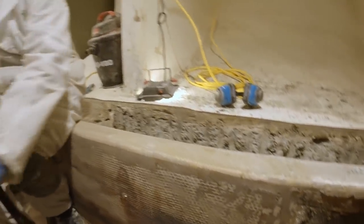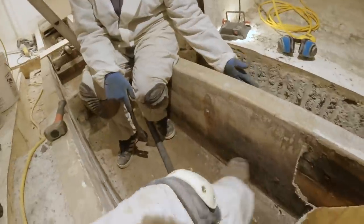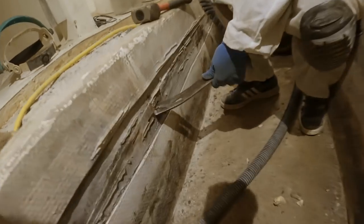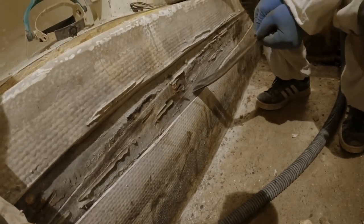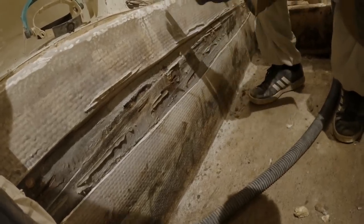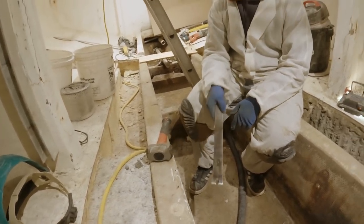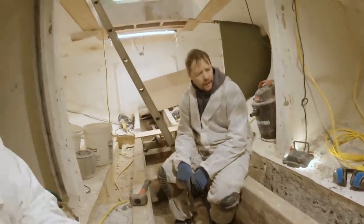We've got shaft alley covers coming down on top of this that are going to be brand new. We've got sumps going in that are brand new. If we attach all that stuff to rotten wood like this, what does that accomplish at the end of the day? Not a whole lot. That's getting pretty well through there. Yep, pretty punky. So this is the time to do it. Otherwise, we'll be thinking about this forever, and we'll regret it, I know that.